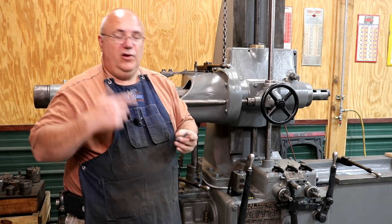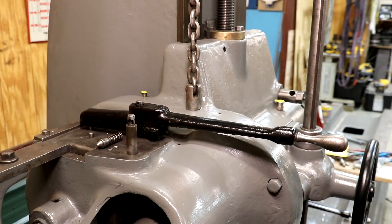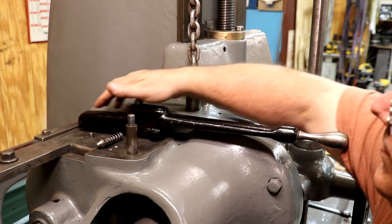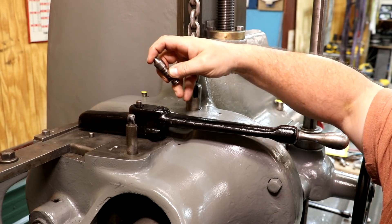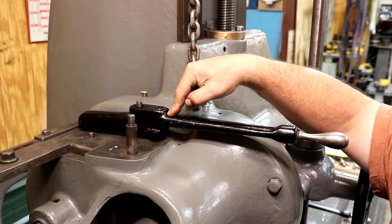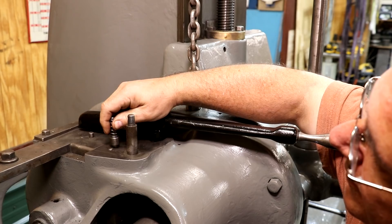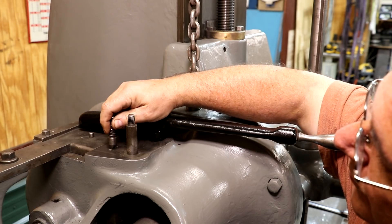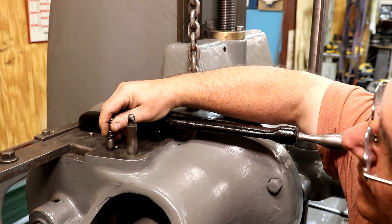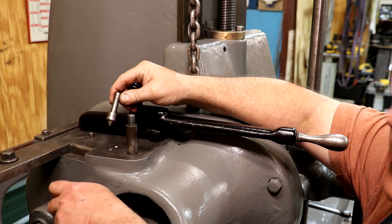I'll show you what we got and then we'll get over on the lathe. It shouldn't be too hard to knock this out. So you can kind of see what's going on — this is the lever, there's a pin right here, a little bronze piece that slides on. The other lever is very similar; they operate kind of the same way. There are two little holes back here, and this little spring-loaded detent just goes back and forth so that whenever you're in one position or the other, it will kind of lock in there and let you easily move it to the other, but that little pin holds it in place. That is the part we need to make.